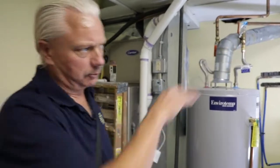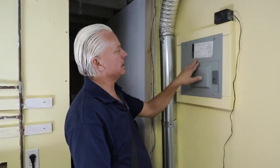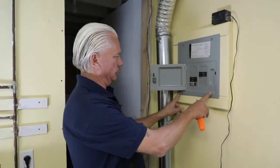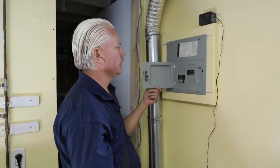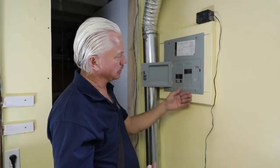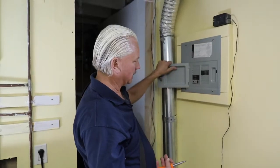We just came from the main panel — I like to do all my panels at the same time. During our initial walk-through we noticed there was a sub-panel downstairs in the mechanical room and laundry. First thing we want to look for is a legend. We do have a legend and our screws. On this one we do have an arc fault breaker that we can test. It's a GE panel — we've had good luck with GEs. You're not required to pull this off, but it's a good idea. You'll notice I brushed it like this to begin with — that way, if it was hot or had a problem, your hands would push away rather than stick.